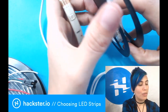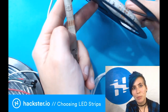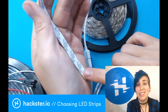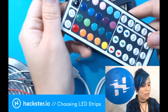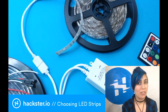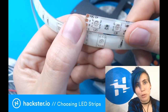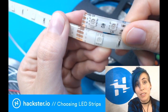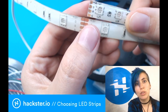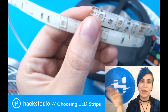When you control these, the entire strip is the same color at once. They run off of 12 volts, although they will also take 9 volts. You can get them with or without a waterproof silicone epoxy coating. They usually come with a sticky 3M self-adhesive backing that isn't super strong but can be reinforced. They often come with an infrared control system, but you can also control them directly by soldering to them or with an Arduino using transistors. One thing to watch out for is that pins may be in a different order — for example, one strip goes 12 volts, blue, red, green, and another goes 12 volts, green, red, blue — so make sure your strips match up, especially if you're chaining them together.